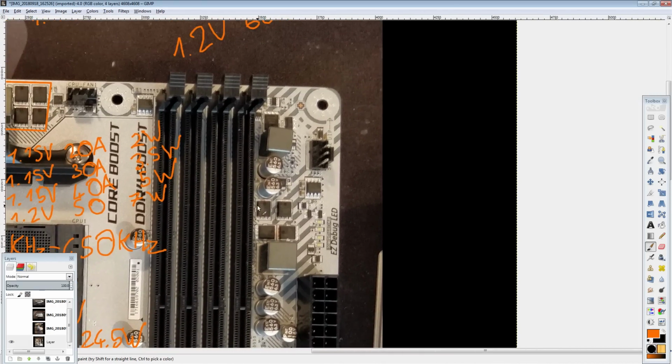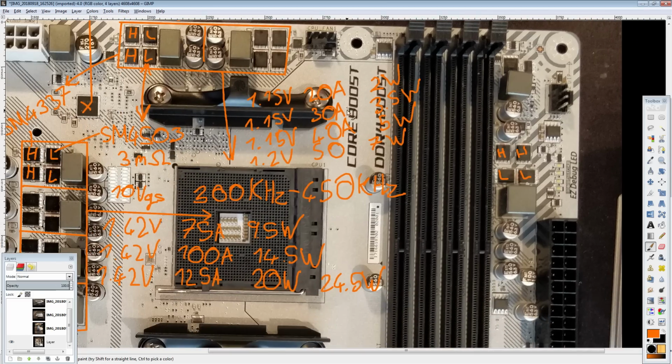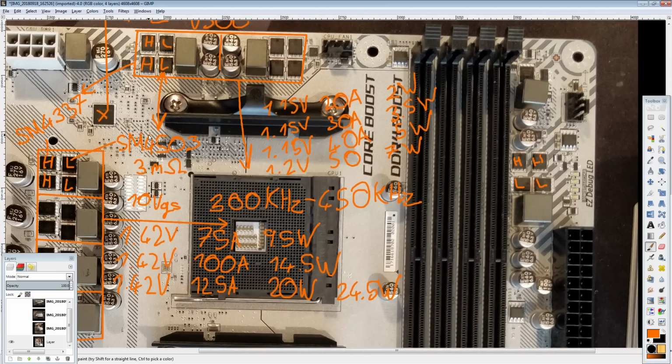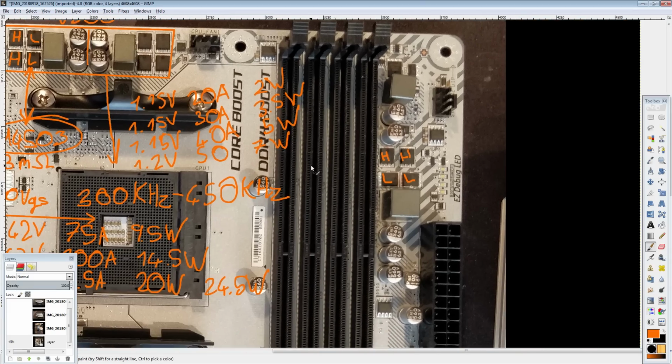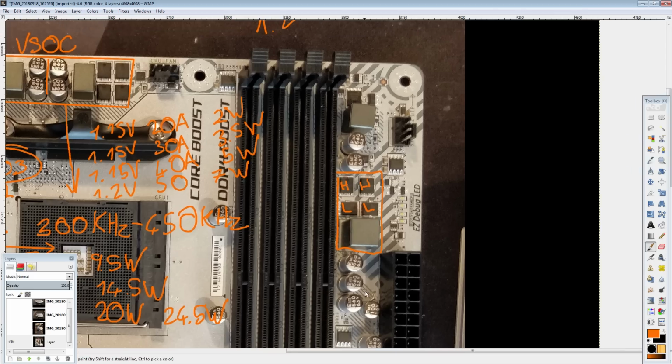Now then, memory VRM, massive overkill here, because guess what? They're still using the same Mosfets, which is a good thing. I mean, if you're buying one part a lot, you might as well just use it everywhere. So you're, again, for the low side, you're on the SM4503s and SM4337s. One inductor, so this is a dead giveaway that this is a single phase, which is fine.